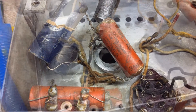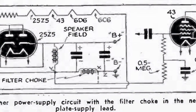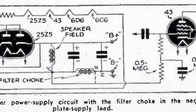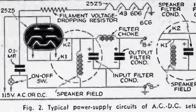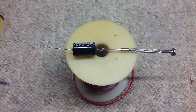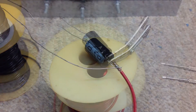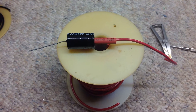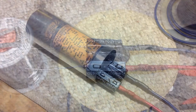Starting off the electrical restoration, I worked on the B-plus power supply. I also found that the B-plus wiring that I documented was wrong — the choke was actually installed on the B-minus side. This caused excessive AC ripple, approximately 10%. Here are just a few photos of the electrolytic capacitors that I used. I had removed the inners of the existing electrolytic can, cut it open, and I'm placing the two electrolytic capacitors back in the original can.